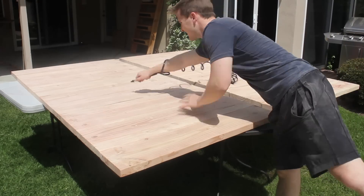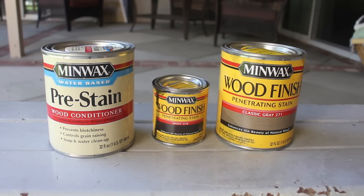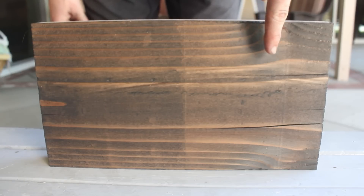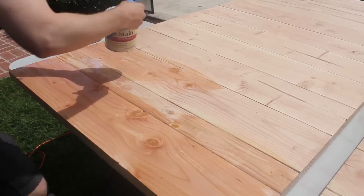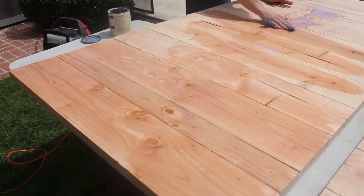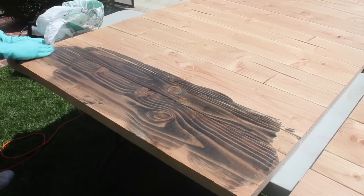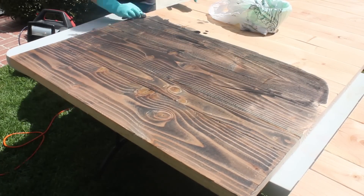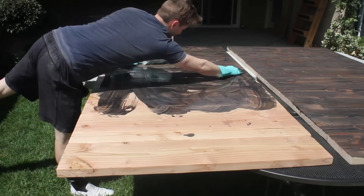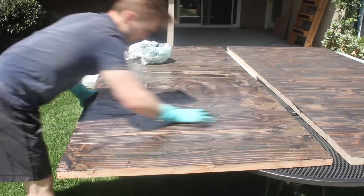For color, I wanted these doors to look great, so I used a pre-stain conditioner and a blend of Minwax's ebony and classic gray stain to achieve a charcoal look. The conditioner makes quite a big difference — simply wipe on an even coat, let it dry for about 15 minutes but no more than two hours, then add your stain. My mix of two colors was done purely by subjective judgment, and since I was applying stain all at once I mixed everything together so I didn't have to worry about varying colors due to different mix ratios.